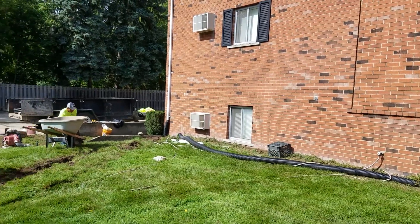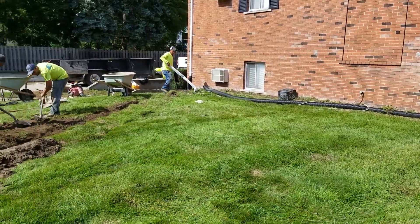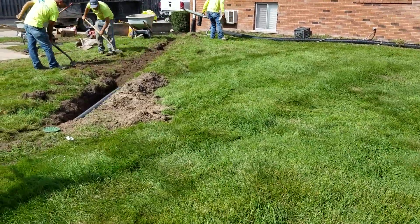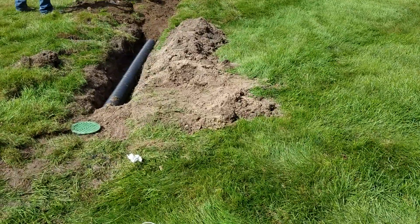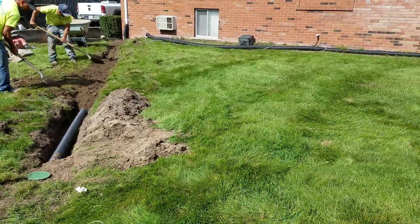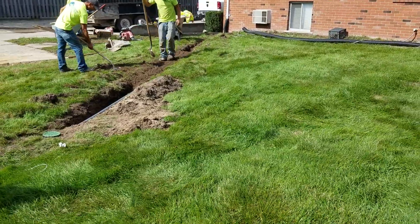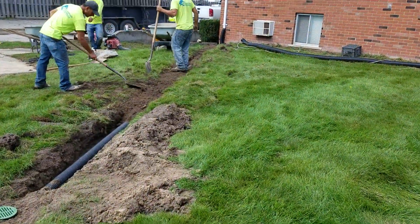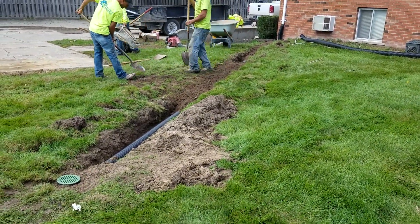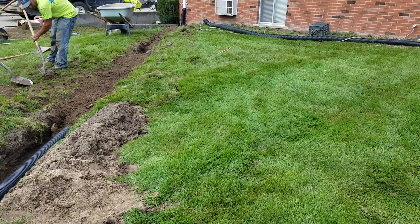This is a long run and we're taking it far away from the building. We're using two 20-foot pieces of dual wall pipe, taking it to a six-inch NDS catch basin so we can clean those leaves out. The smooth inner wall is going to let the leaves run through this pipe — it's like a slip and slide, like a luge. All the leaves come down into the NDS catch basin, so maintenance is literally just take the lid off and clean the leaves out.